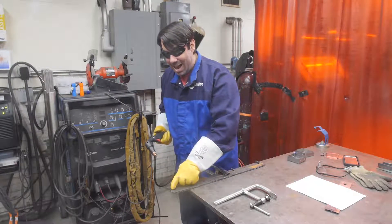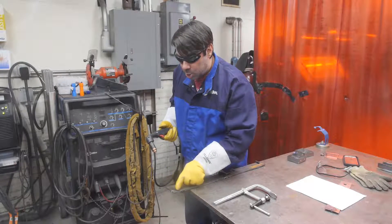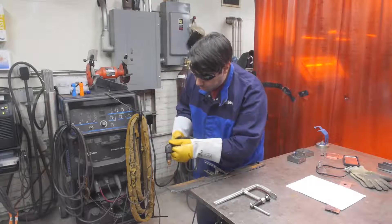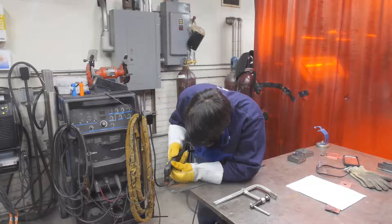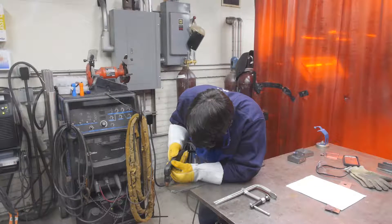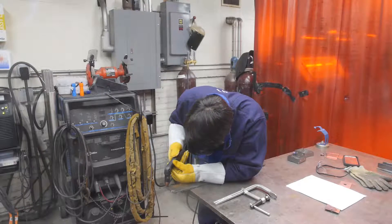I have a cut line drawn on my workpiece and it begins at the right-hand corner of my part. I'm simply going to lower the torch down to the initial location where it begins on the edge of my part. Once I strike the arc by pulling the trigger, I simply start following the path just like any other plasma cutting. We're ready to begin with the demo. Eyes.